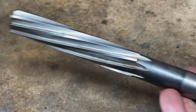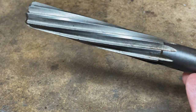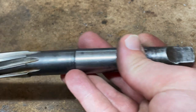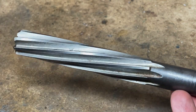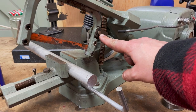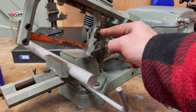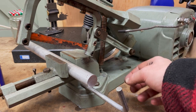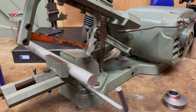What you just saw was this secondhand three-quarter inch reamer spinning inside the Morse taper on my tailstock, and that's because it is blunt as anything. I didn't realise this E-clip was missing, so there was nothing stopping the saw and this from becoming completely detached and probably causing some major damage, but I've replaced that E-clip now, so let's get this cut.